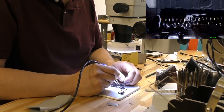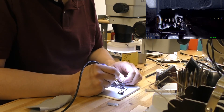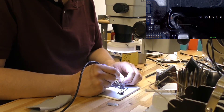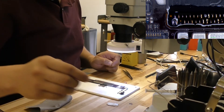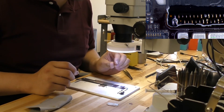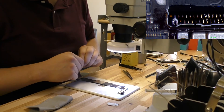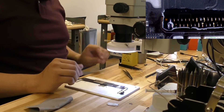I'm just going back through to make sure that it is soldered. I'm actually pressing down a little bit. Sometimes with the flex cable it tends to kind of bend upward, and when you actually put the solder on the pad on the ribbon, it doesn't actually seem like it's soldered onto the pad but not the actual board. On the iPad Air it's a little bit easier to see because the ribbon is a little bit transparent — you can see the flux kind of just flow from underneath the pad, and that's one way you can tell it's soldered to the board. But on the minis, the ribbon is black, so you can't really tell — just go one by one and take your time.